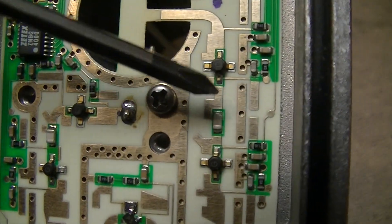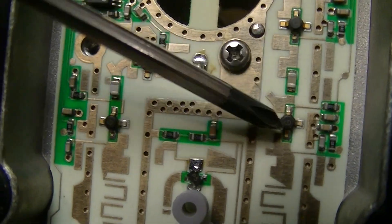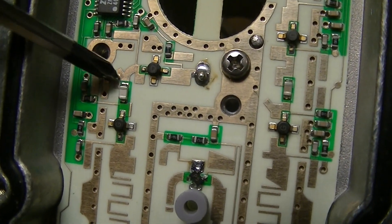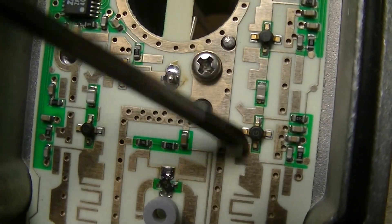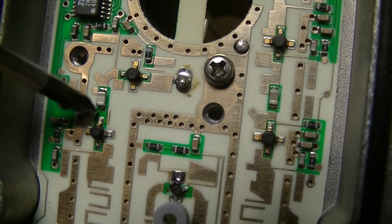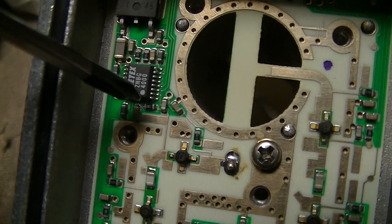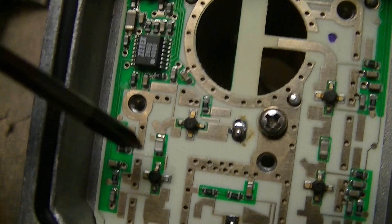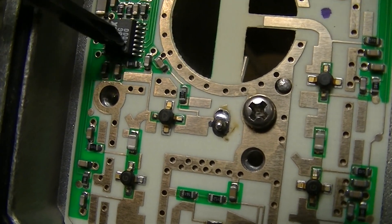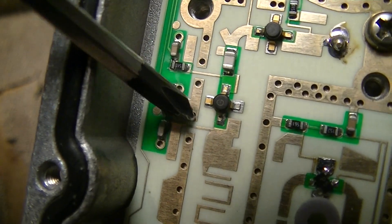Then there are two separate signal paths, and a lot of this is going to be just filtering, although I have no idea how much of this works because this is a couple of orders of magnitude above my paltry RF experience. These are all, I'm guessing, RF-grade FETs, because there's this thing over here — it's a ZX ZNBG 4000 Quad FET driver — and a lot of the traces on some of these devices are connected by traces leading over to this thing. So these are probably just RF FETs for various stages of amplification.